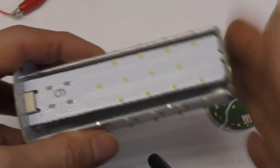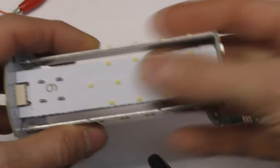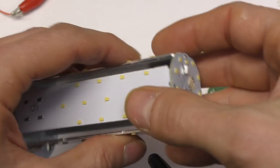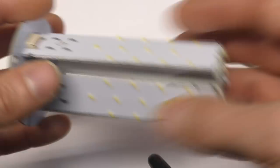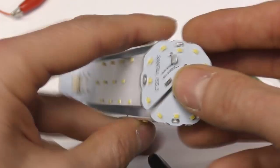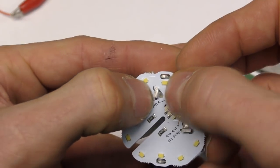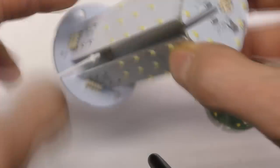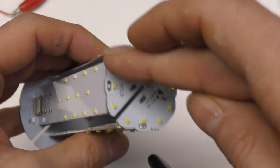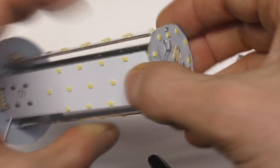The first version of this, we didn't have the bottom infill board, so we just had these 4 aluminium PCBs. And one little detail that I came up with fairly quickly to hold this thing together is that you could put a tab on the aluminium PCB and just give it a 45-degree twist to lock it together. And the first version had this detail on all 4 sides.